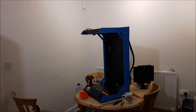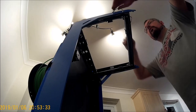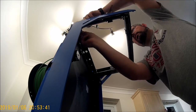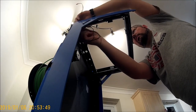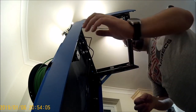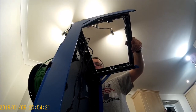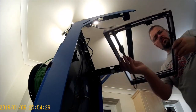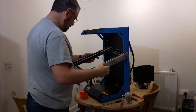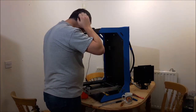Finally, there's some cabling that goes to the two limit switches on the top of the printer and also to the lighting, which I've taken off my machine. That had to be pulled back. I tied a little knot in the end of the limit switch cable for one of the axes just so I know. And there you go — undo those screws holding it in and that's the whole XY table out.